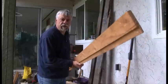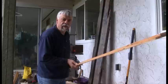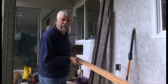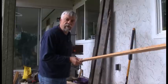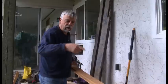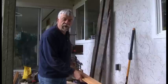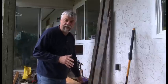What I'm going to be doing — I have this piece of plywood, actually two pieces of thin plywood that I have screwed together. This is the factory side of a sheet of plywood and I'm going to be using that as my straight edge. I'm going to be using my circular saw to run down the length of this, and I'm going to now go about clamping this onto my hardwood — onto my oak here that I'm going to start breaking down.